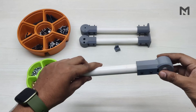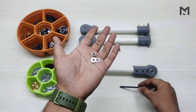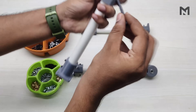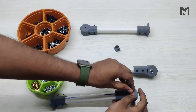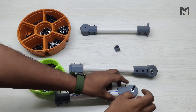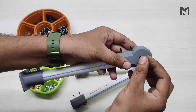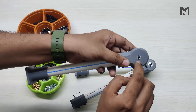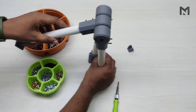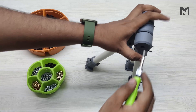Now all the arms have been completed, it's time to attach them together. I am using an M5 bolt of 70mm length along with two washers and a nut to connect all three arms. Take the vertical arm and insert the bolt into the center hole, then place it horizontally and insert the washer on the bolt. I am using a washer between the vertical arm and the rotating arm to eliminate friction losses. While placing the second vertical arm, insert a nut into the hexagon groove in its upper part. After attaching all the arms, the assembly will be ready. Recheck the movement of the rotating arm and adjust the fit by tightening or loosening the bolt.